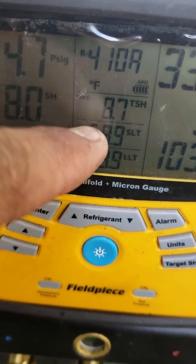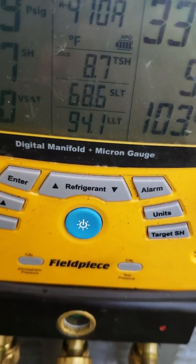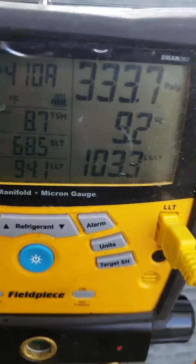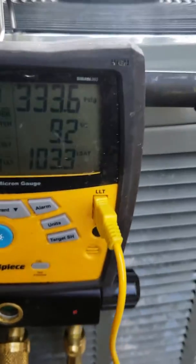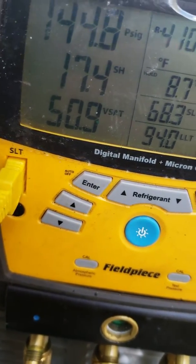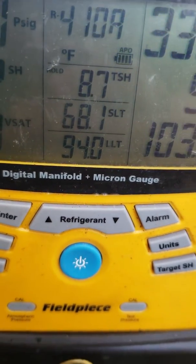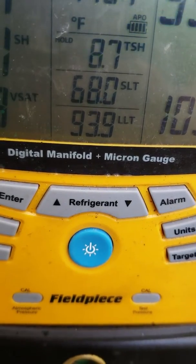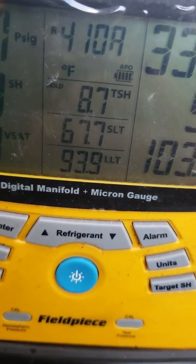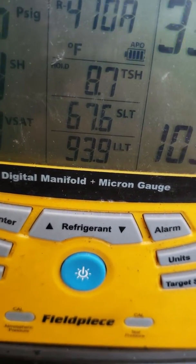It was in the high 70s, now it's in the 60s and dropping. I think in another five more minutes that'll be in the 50s. If not, I'll add a little freon and bring that superheat down — sub cooling will go up a little bit, but the superheat can go down a little. It looks like it's going down, and 50 over 103 is good. 60.8 over 93 — not bad. About 30 degrees, going to end up being 40 degrees line temperature split.